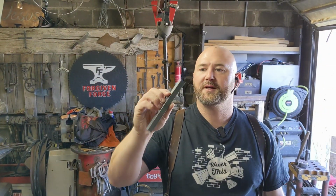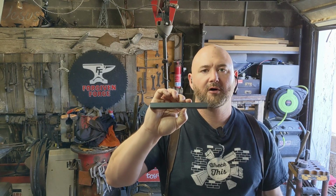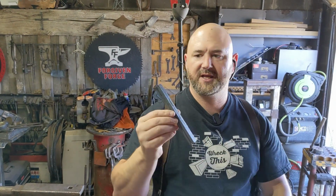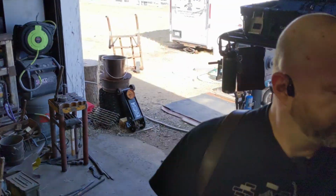And so here's what they're made out of. It's a piece of 6 7/8 long, 5/8 square stock. And I have a jig that I may have already shot some video of, a jig that will cut them. This isn't fully cut here, but we split the two sides, split one way, turn it 90 degrees, split up the other. And then you actually cut the one end, the crossbar, shorter, and the top is shorter.